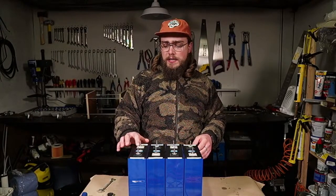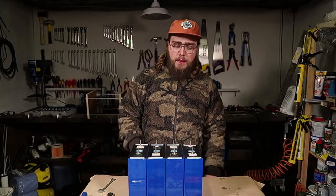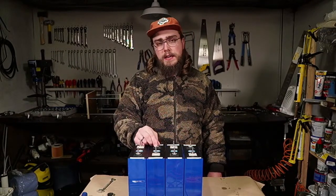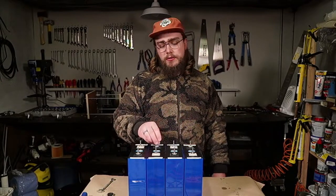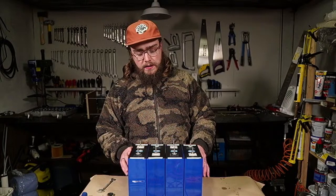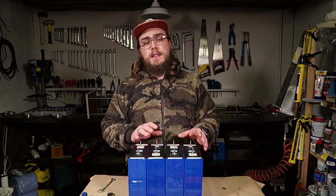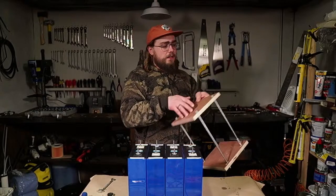These particular ones have quite a small surface area, and with just an M6 thread, it's not the strongest thing around. So when that stripped, I took it all apart, drilled it out, tapped a new thread, and put a 6mm helicoil in there, then put a new grub screw in. It's pretty tight. I made a video of the process — with it being aluminium you have to take quite a lot of care. That'll be on our YouTube channel, probably released Sunday.